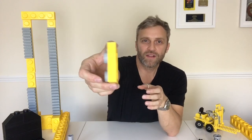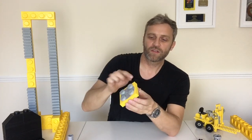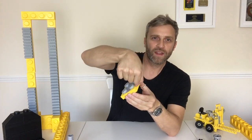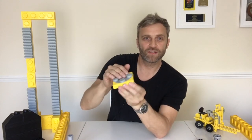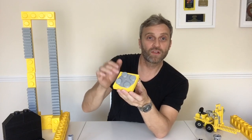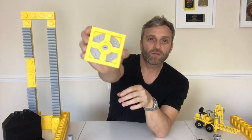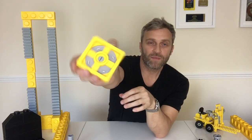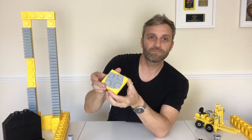And the yellow part is two parts as well. And it's glued together. So you've got another nice smooth surface where that grey part meets it and beds down. And basically to try and keep the friction down as low as possible. So that's screwed and glued together and then just snapped in from the top, and that little grey pip holds it together in from the bottom there. So that worked out really nicely, and yeah, very pleased with that.